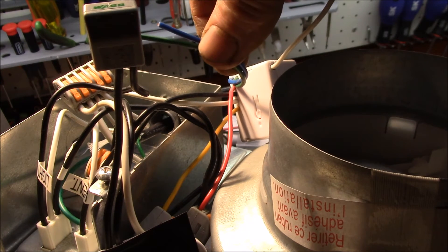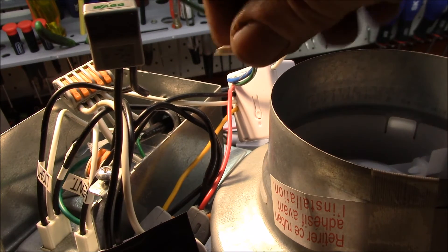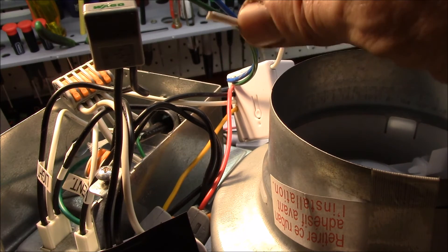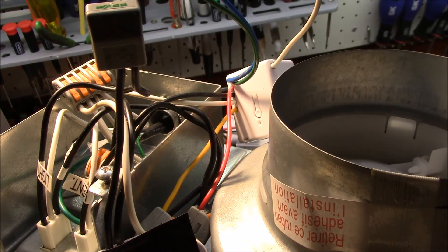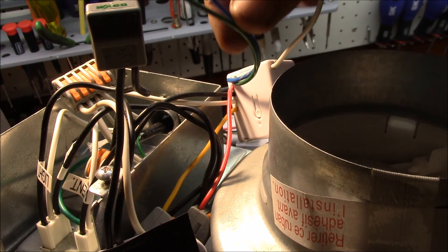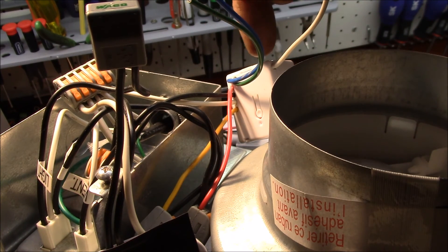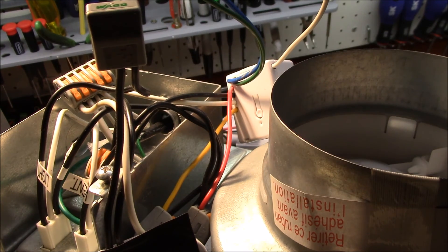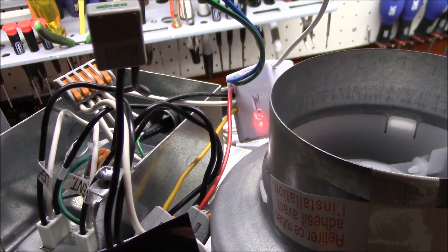This is the Monoprice dual relay module. I don't have the switches connected because I don't have any switches to connect. The idea is I'll have a Z-wave switch on the wall in the bathroom that will communicate over RF to this receiver — you can see the antenna here. The dimmer also has an antenna, so the switches won't be wired at all. To pair this device, you hit that pairing switch — you can probably see the red LED blinking — and then we go look at the Vera screen to see what that looks like.